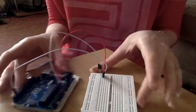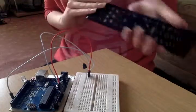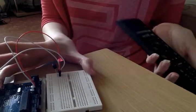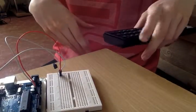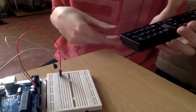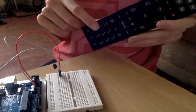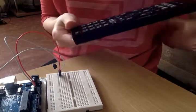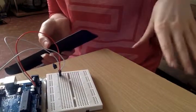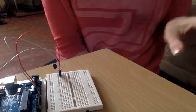What it lets you do is: you take your remote control — for example, I just use my television remote. I'll put the code in the description. Using the receive code, all you have to do is point your remote at the IR receiver and press any of the buttons you want the Arduino to control. I wanted it to change the channel up and down, so I pressed the channel button and the receive code gave me a long line of numbers.